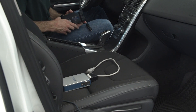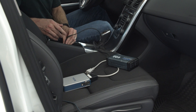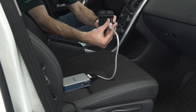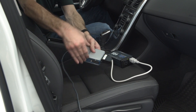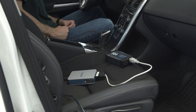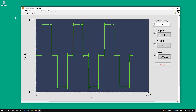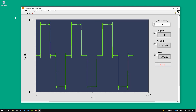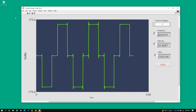That's what I would expect — pretty good. Now we're in the garage and I'm going to plug the standard modified sine wave inverter into my car. I plug the DC adapter in, then plug in the connection from my instrumentation into the inverter and make sure the inverter is on. You can see that the inverter is significantly choppier than what we saw in the wall. This is a low-cost inverter, and it's a modified sine wave that doesn't even look like a sine wave — it's more like a square wave.